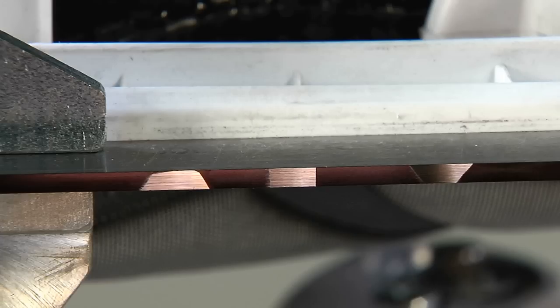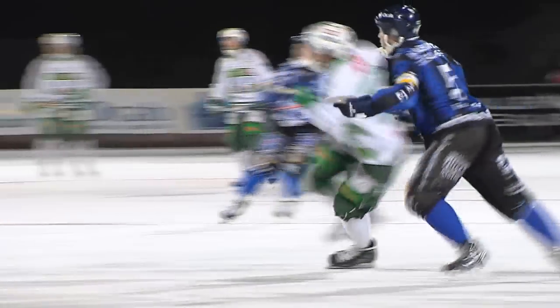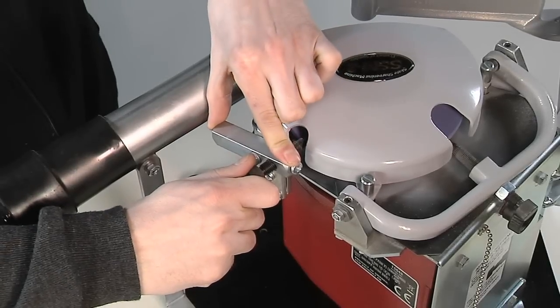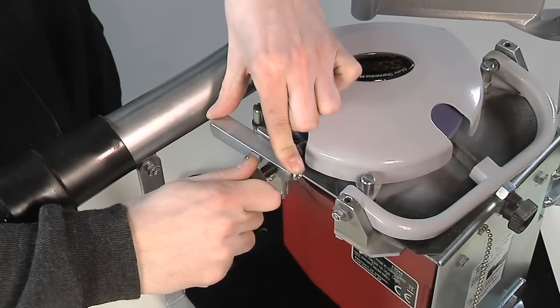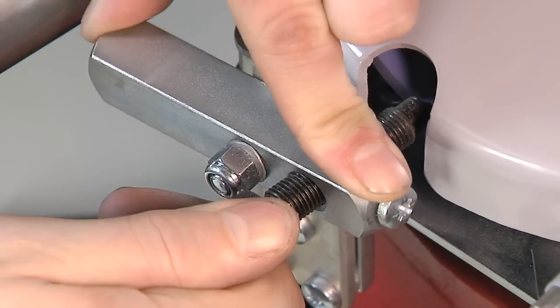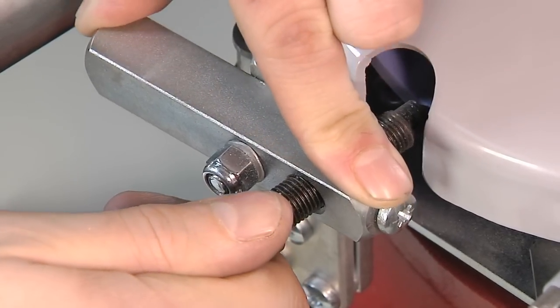The reason you might need to change the position of the blade support roller is that the thickness of skate blades can vary. To sharpen bandy skates and long distance skates, screw the diamond in in small increments while you move the flat surface device up and down. The last movement should result in grinding. Grind gently.